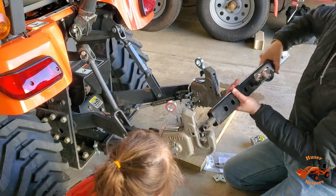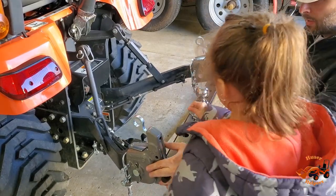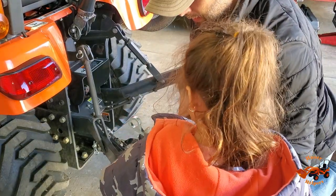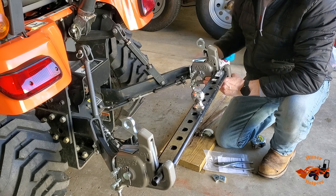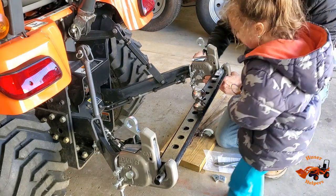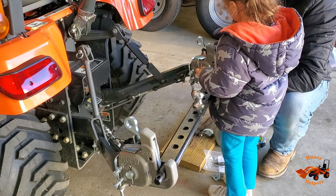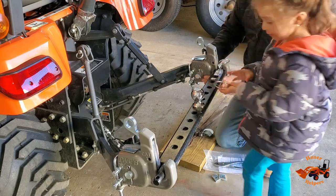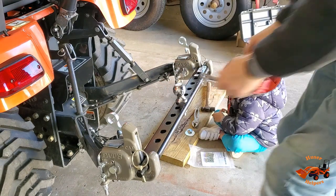Taking the bar and putting it back through the PAT system to get a spread of 26 inches, then adjusting the PAT system on the lift arms to make sure they're sitting as square as possible to the implement. Using a 9/16 socket, screwing in from the outside to that maximum point. The wider out I spread, the more I need tightened on the inside. That should do the PAT system for that part.